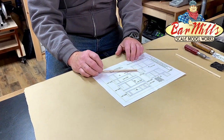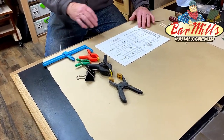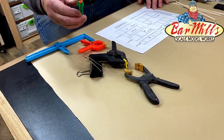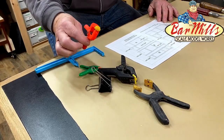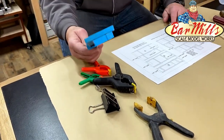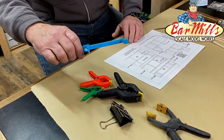The best way is to clamp it with yellow glue and let it dry good before you start working with it, then move on to the next step. Clamps are essential when putting these together — they make the glue dry a little quicker because when you clamp them tight, the glue cures a little bit better. We have a bunch of little clamps here. These small spring clamps you can get almost anywhere — Harbor Freight sells them, twenty for five dollars, and they come with a couple of big ones. Then there are some larger, stronger ones. Art likes these document clips — they make great clamps. Then you can get a bar clamp like this that works out pretty well. The reason I like bar clamps is because they have a 90-degree angle — if I'm trying to keep a building square, I can slide it in, get it tight, and still keep it square.